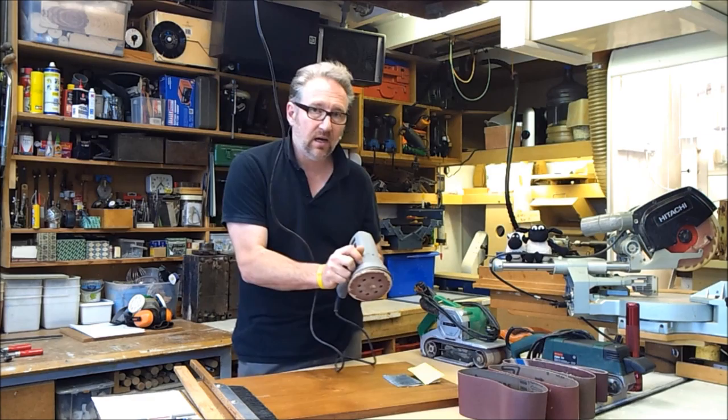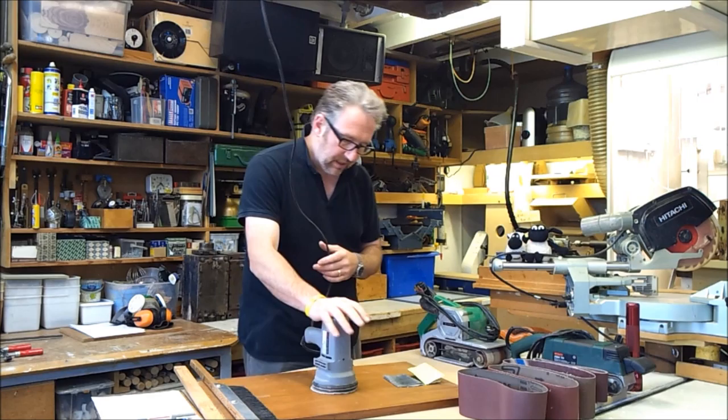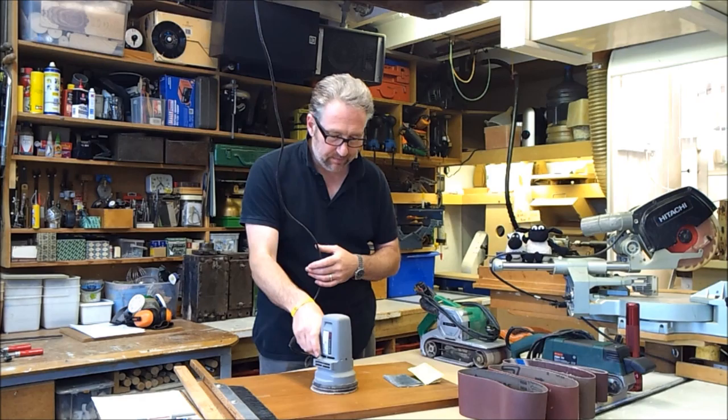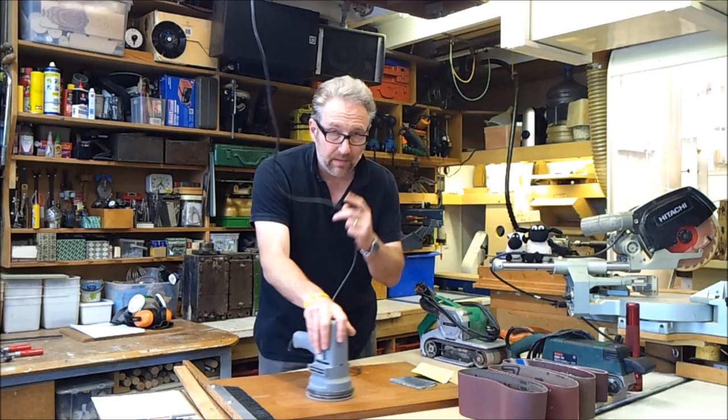So, orbital sander — it's quite a nice quiet model, actually. All sanding devices should come with a port and a little attachment whereby you can attach a hoover or vacuum to it. That's a really good idea — obviously if you bought one yourself you'll have all the attachments, do use them, especially with these because they produce some very fine dust. The orbital sander is quite an easy thing to use; basically you just keep palm pressure on it. When it's turned on, I'll just experiment very briefly — I'll turn it on and you'll see what I mean.